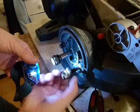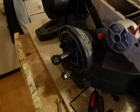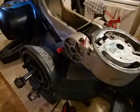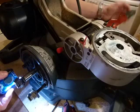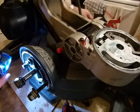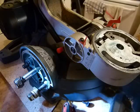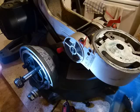These rods connect to the front — there are two levers at the front. When I operate this lever you can see this rod being extended and retracted, and when I operate the turn knob you can see this push rod retracted and extended. So that's how this saw works. I'm going to put it together and in the next video you can see the actual adjustments and fine-tuning of the compound miter saw.